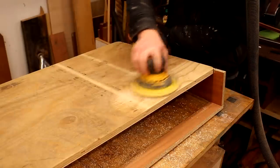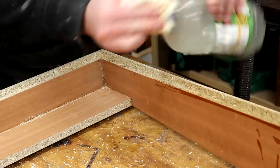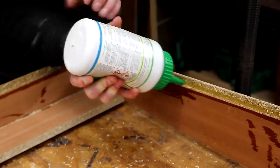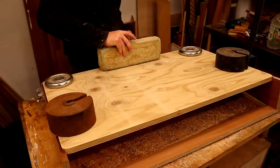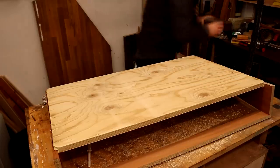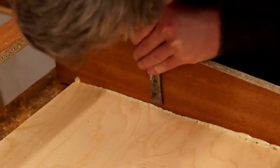This plywood was really dirty on one side so I sanded it clean. To glue the base in, I decided to use some new polyurethane glue that I've just got delivered, which is meant to be a really good gap-filling adhesive as it foams up — I'll leave a link to this in the description box. First you need to dampen one of the surfaces with a wet cloth and then apply the glue. After about five or ten minutes the foam starts to appear and I scraped that away as it was drying. When I flipped it over I found the glue had foamed up on the inside too, but it was pretty easy to clean off with a chisel even when it was dry.